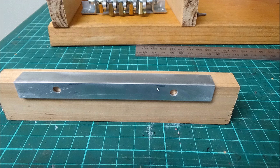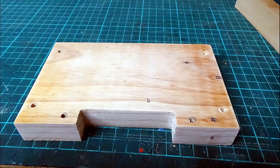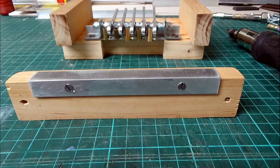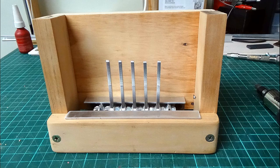Here we are putting the box together, working out measurements. The box is basically bigger than the frame, so we just work it out and try to keep a consistent look. This piece of aluminium angle is going on the front section, which is removable, and there will also be some combing glued to the top. Being removable allows me to lift it off and get good access to the workings inside. The back is produced with a cutout for the bottom of the levers to give a bit more clearance. We've also rounded off the corners because working in confined spaces you don't want sharp edges, especially with children around — this will be at little kids' head height.